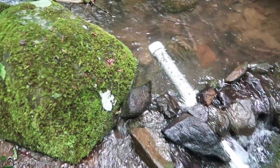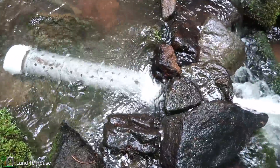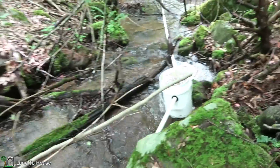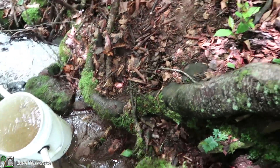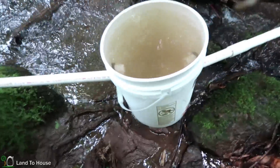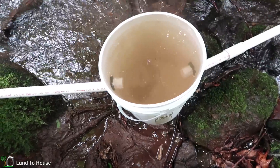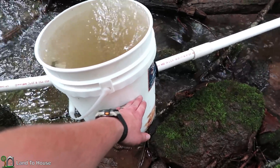Let me show you the final setup here. We have the screened intake set quite nicely, totally submerged. One-inch pipe comes out, travels down the creek, and feeds into the bucket. As you can see, it's overflowing quite nicely. Now the reason the bucket is used is two-part: it provides a constant steady source of water for the ram pump so it's never going to be gulping any air, and it's also able to catch silt and sediment as it pours out from the intake. So we have somewhere around six inches or more of potential before this is going to be stopping the ram pump.